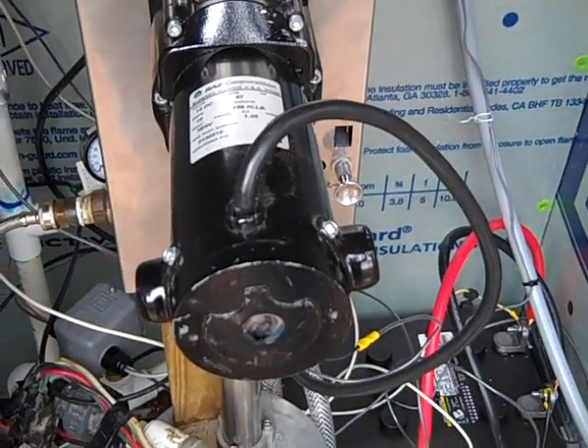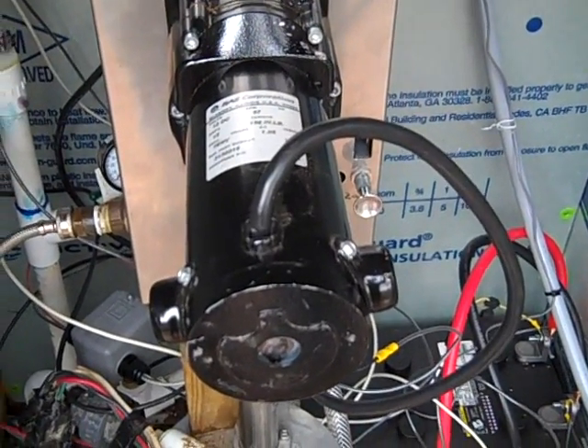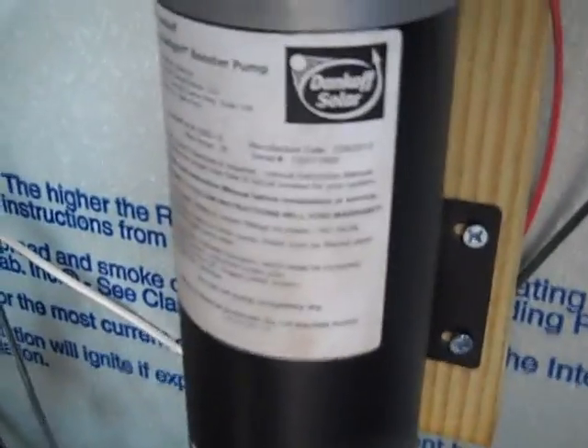This way there's not a lot of load on the simple pump — it's just lifting water into the tank. When the tank is full it'll shut off. To get the water from that tank into the house, I'm using a Dankoff Flowlight booster pump. That line there comes in from the tank, runs through a pre-filter, then it's boosted and run back through to the house.